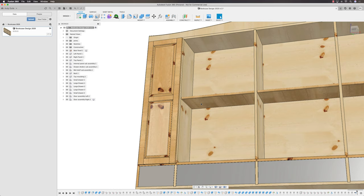I always go to the effort of actually modelling up the raised panel doors, including the stiles, rails, and cope and stick joinery, because it makes the workshop activity easier — all the material is sized out for me. I use parametric modelling, so as I resize things the door changes. It's a very quick and easy way of doing this. Let's get straight into it.